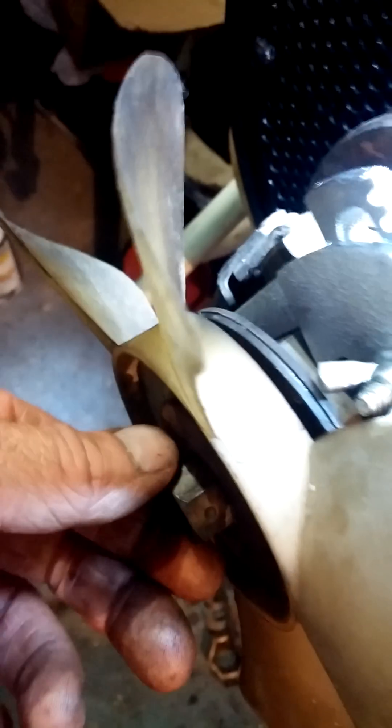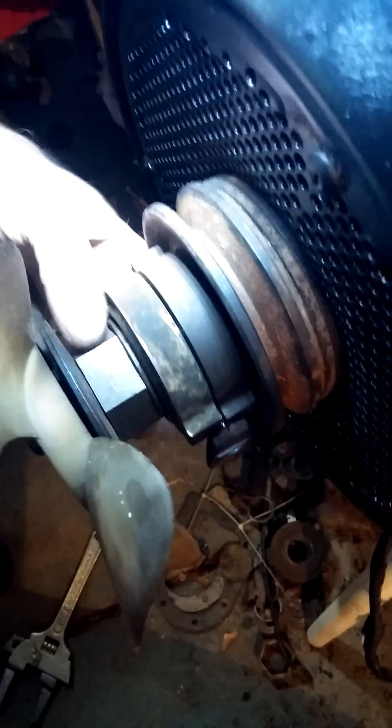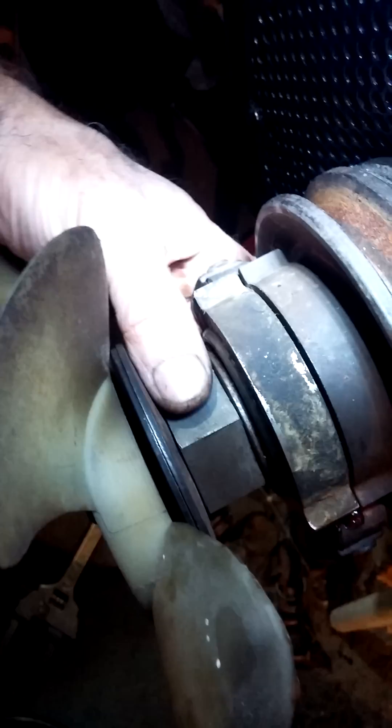When there's just two thousandths play, you take and hold this big nut in place and tighten the front nut up to spec - I think it's 40 foot pounds. This should be just about enough to collapse these convex washers. When they collapse, it creates a lot of force from here through this shoulder bolt onto this washer, which pushes the assembly and in turn the clutch right into the friction disc. Make sure that flat washer stays on that shoulder, because if it doesn't, it won't work.